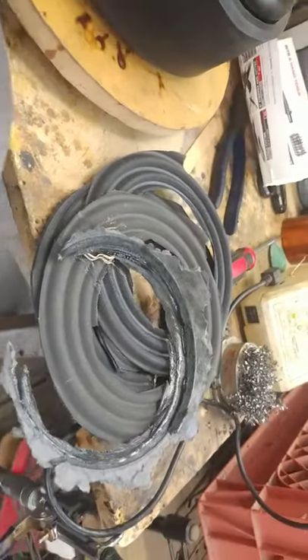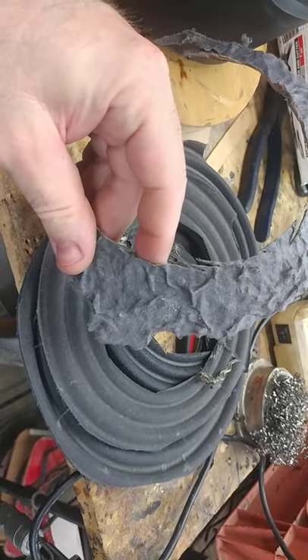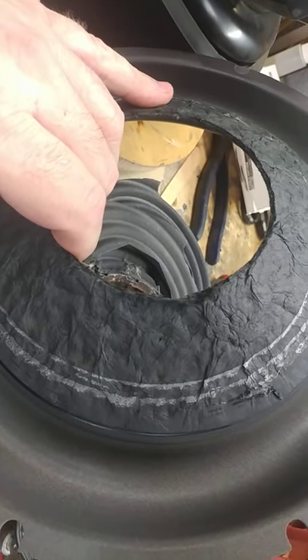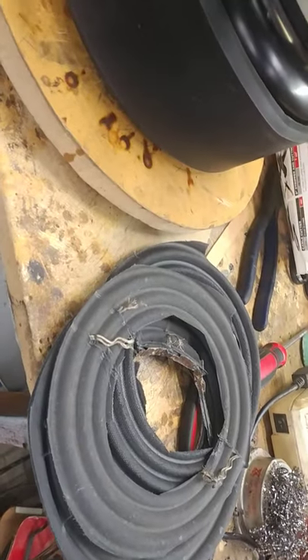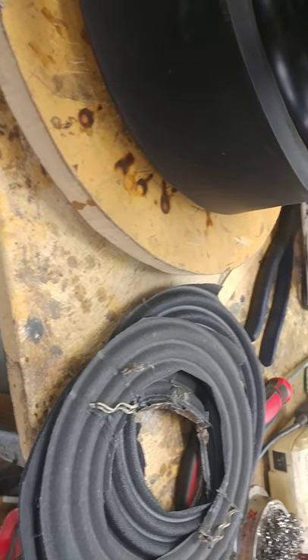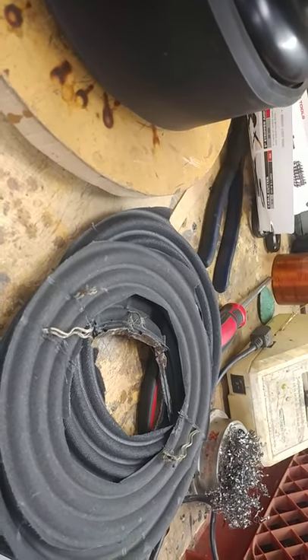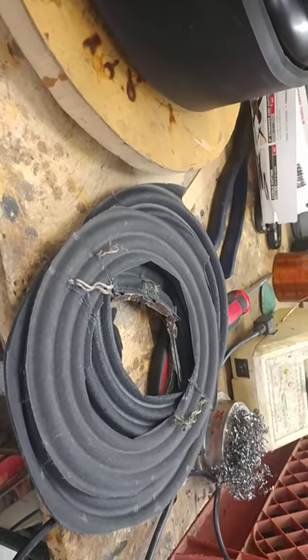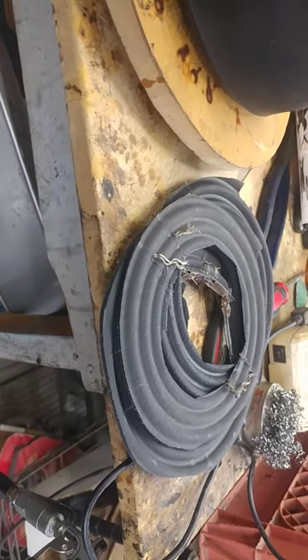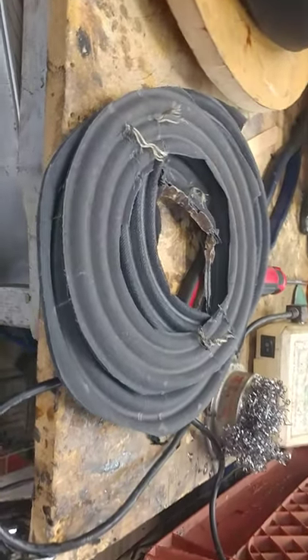This one looks like a single press. There's a non-pressed version — I think that's theirs — which looks a little more Freddy Krueger on the back. Then there's single press, and then they have one that's double press, which is like the Rockford T1 — that one's pretty smooth on the back. There are different properties for the cones; the double press ones tend to be more brittle, which is why I think Rockford moved to a metal cone on the T2.